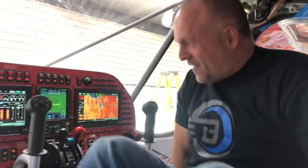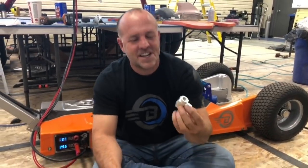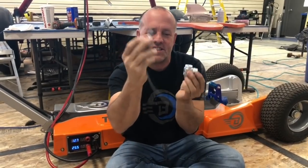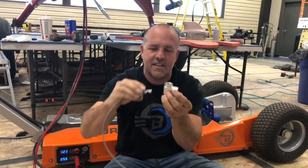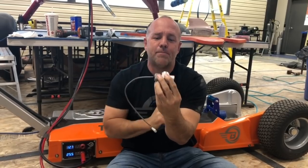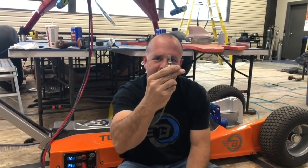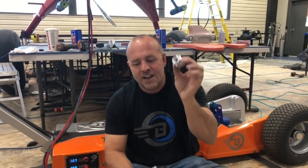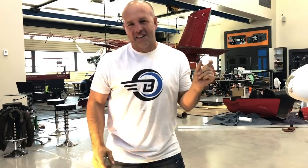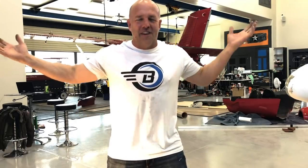I just got back from the machine shop. This is the part I needed to make — it's got very large lines where the fuel will pass through, a 90-degree turn, and it just sticks in the corner. I've opened up the inside of this a lot so the sensor can thread into it. Now I have an unobstructed pass-through and the ultrasonic sensor trigger is right in line with the fuel flow — no flow loss, and the sensor is ready to go. Let's go install them. I hope you enjoyed it — I added a little extra video if you want to see a simple part being made. It's got so much to do; I'm going back to work.